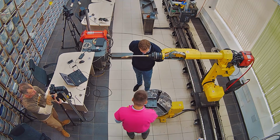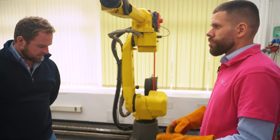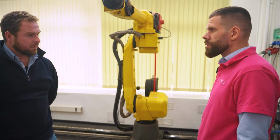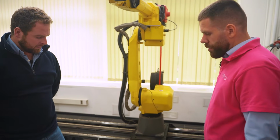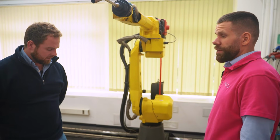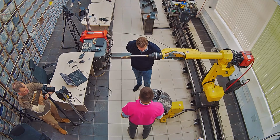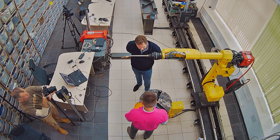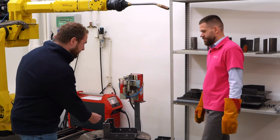It may take, for example, a few weeks in order to find out the good welding parameters for your metals. That is why it might be quite expensive. So if you have these parameters already achieved somewhere, it's maybe a good idea to buy them. Can you store those parameters in the system? Yes, you may store them and reuse them with another robot in another situation. So we have a good seam by weaving.